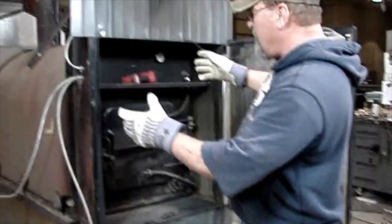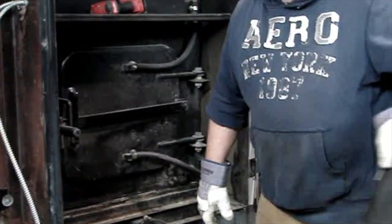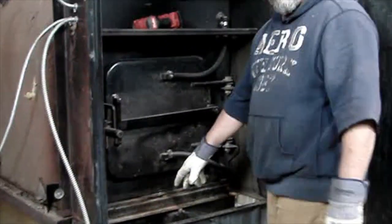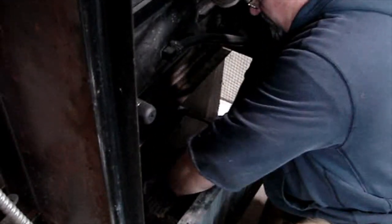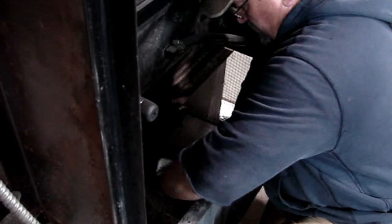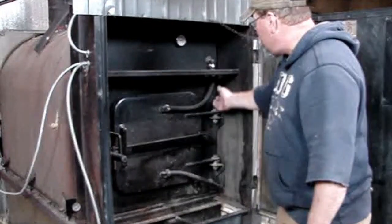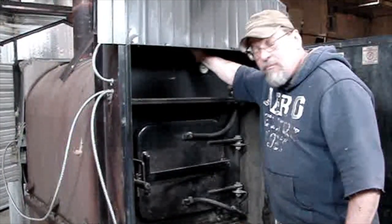Okay, once the insulation is taken off, then you come around to the front of the furnace. Pull off the fan cover, which exposes your blower fan, and my assistant will take that. There are 2 plastic thumb screws here that hold the combustion fan on. So now we're taking the blower fan off. You want to take your door hoses off, the bottom hose, top hose, as well as your bladder hose up here. That needs to be removed as well.